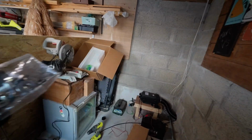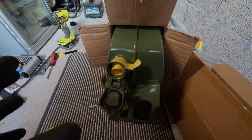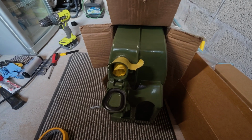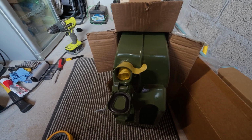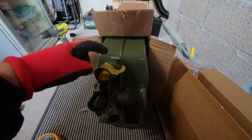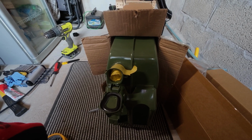But the idea is if you don't vent it, then the suction will stop the fuel coming through, so you'll have issues. So you do need a vent if you're going to do it this way. So that's what I'm going to do next. I'm going to drill the 2 holes and we're going to put the bits and pieces in. Now the vent, I'm going to have above the takeoff. No reasoning to it, but that's the way I think I'm going to do it.